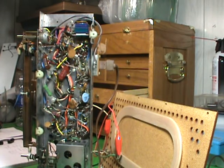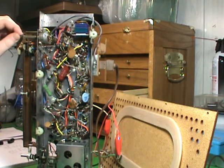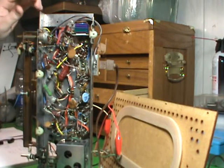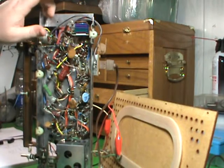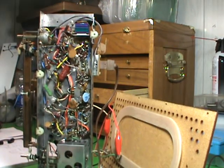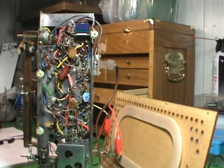I had this earlier up on the bench and tested it. I used two multi-can caps and a bunch of test leads to go from ground to each pin — 80, 60, and 40 — and the hum was all but eliminated. Aside from normal AM hum, volume and voltage were increased across all points. So, we can basically determine that the filter capacitor is bad.